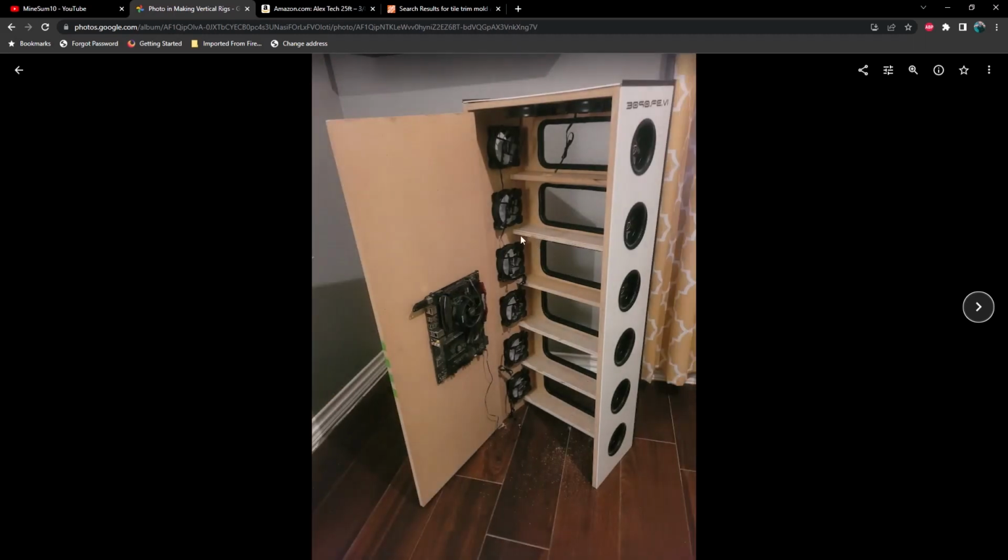Now, as far as these wires coming out of the fans are concerned, the fans that I use, they come with a hub and a proprietary plug, and you only have so much cable on these. So just one thing to be cautious of if you're going to build something like this for yourself: the taller you go with this case, the further away the top fan is going to be from the hub, which will probably be located somewhere in the center. And if this cable isn't long enough to reach that, you're going to have some real problems.